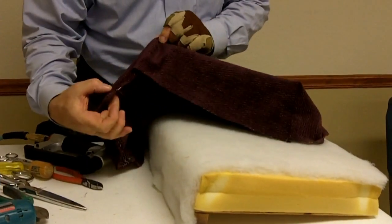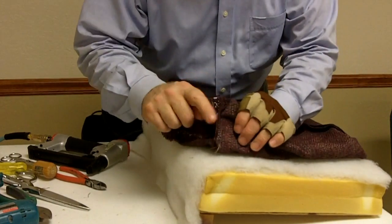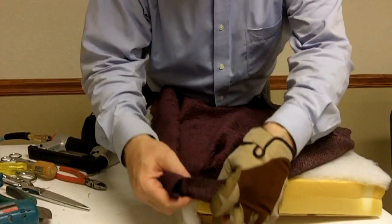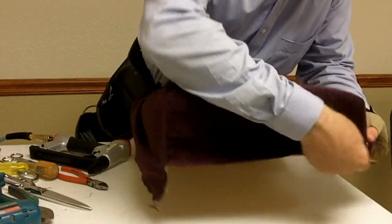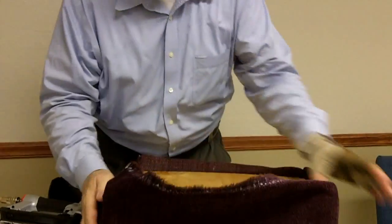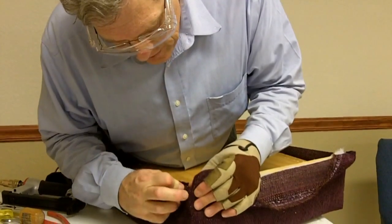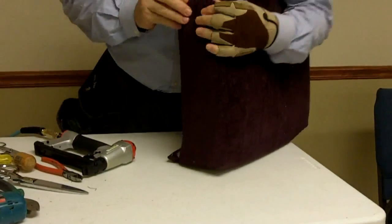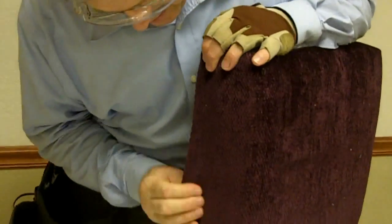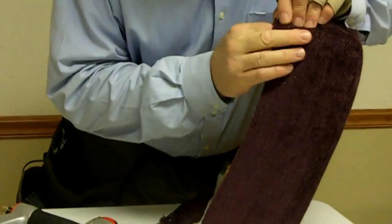On the cover, the long tail goes to the front. Turn them inside out. The selvedge goes to the front so that the open edge of the seam goes to the side — it's the prettiest that way. You're at the right depth when about a half inch of fabric is going over the top edge at the front corner and the seam is right on the corner. Put a couple of staples in, and use your finger width as a consistent measurement guide for how far to pull each side.